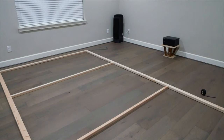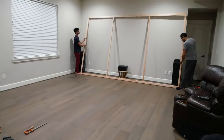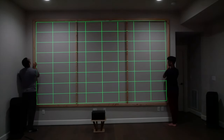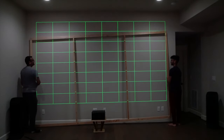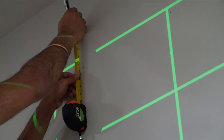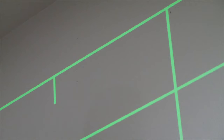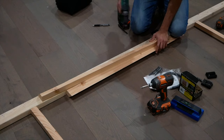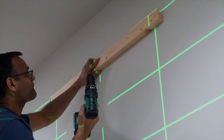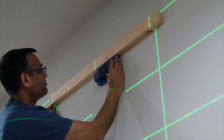This is how our frame looked after being assembled. A trick we found was that we could align the vertical pieces with the seams of our hardwood flooring—the floors line up with the frame, which is an awesome way to double-check that everything is nice and square. We brought our frame to the wall and lined it up with our projection just to see how it would look. Once we were sure everything was correctly assembled, we set the frame down and started installing our French cleat. We measured the width of our French cleat and frame together, which was 6 and a quarter inches, then measured 3 inches higher than the projection for the width of the black felt tape we'll be installing on the border. We drilled holes into the cleat and screwed them into the studs of our wall. It's really important that you screw the cleat into the studs—at 5 feet long, we were able to attach our cleat into 3 studs, so that's not going anywhere.